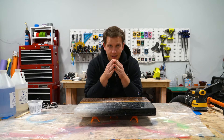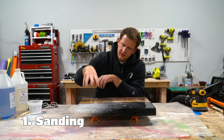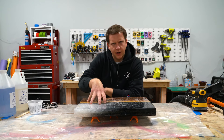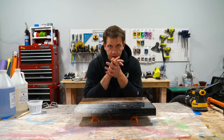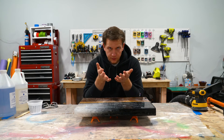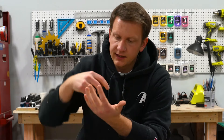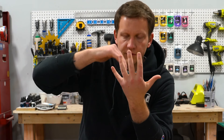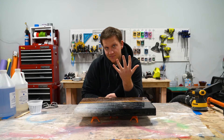The first step is sanding. We want this scratched-up coat to have a nice chemical bond to the coat we're going to pour on top of it. Surface area is important for these two pours because we want the maximum amount of contact between them as possible. Sanding naturally puts grooves and cuts into that top surface, increasing the actual surface area available to bond to.